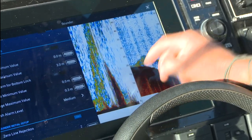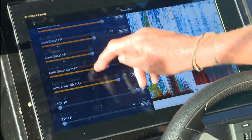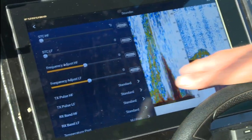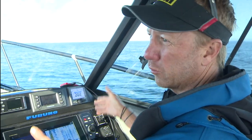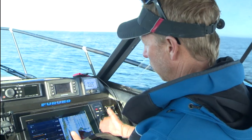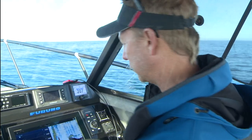There's a nice dark patch right there. We've also got frequency adjust — I can adjust the frequency that my two transducers are firing out. At the moment when it's in the middle, it's at 38 kilohertz. I can adjust that down to about 32 kilohertz, or bring it up to 42 or 44 kilohertz. I find that just leaving it at 38 while we're in this sort of depth is fine. Once I get out beyond 400 or 500 meters, I lower the frequency, because a lower frequency gets better penetration.